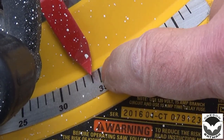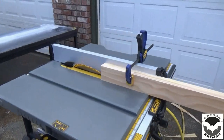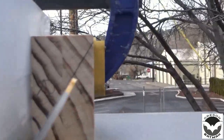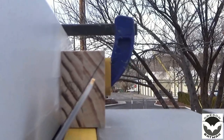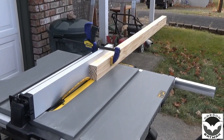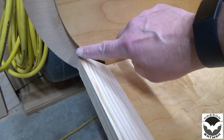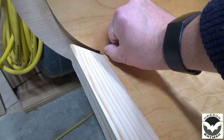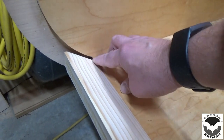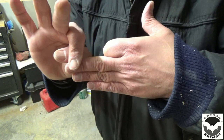I set my table saw up, started at 34 and a half degrees, backed it off just slightly because I've got my wood clamped on here so I can check the angle to my blade. There's our line, and our blade is about in line with that. That was a successful cut! So our ceiling is going to wrap around here, and then about right in here it's going to rest on our piece of wood, flatten out about right in here a half inch or so away. We'll put a piece of trim across here in the front to hide any seams. Happy to report, I kept all my fingers.